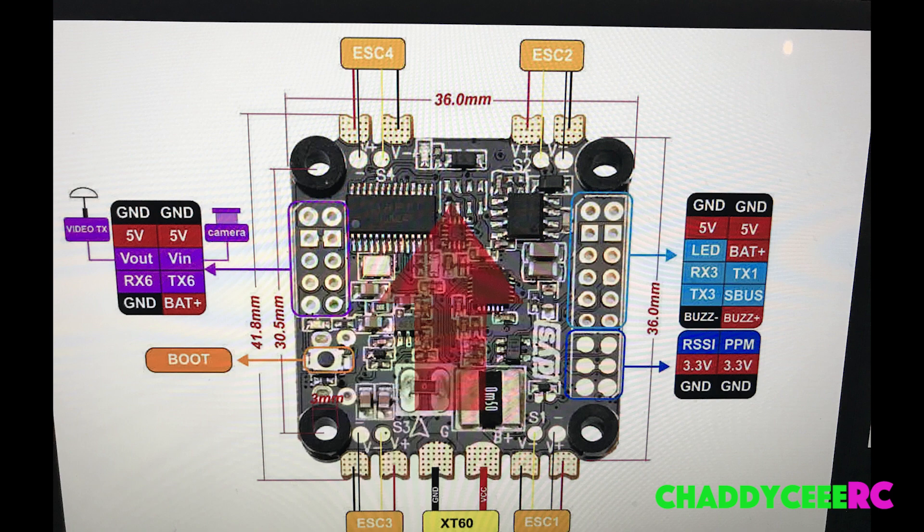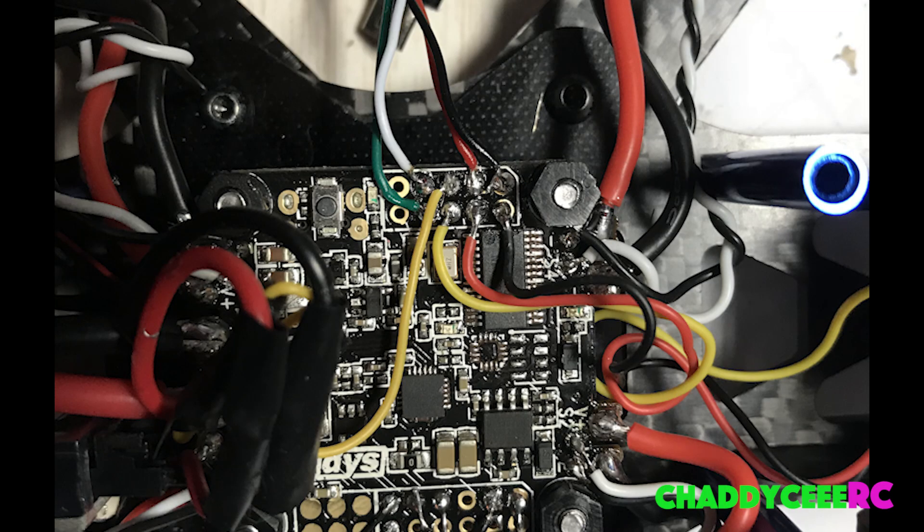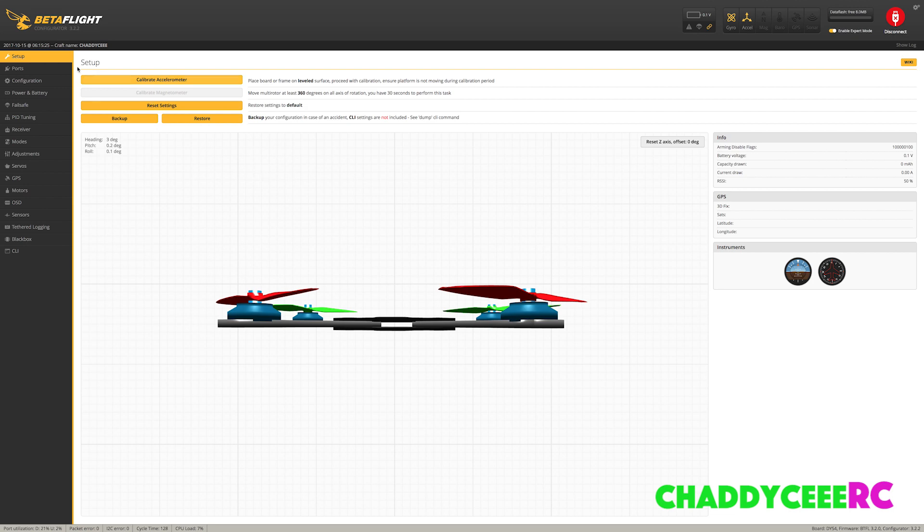When it's all said and done, this is what it looks like: power on 5 volts, the white wire going to RX, and the green wire going to TX. There are two white wires, but you're not going to use the one that comes with the connector on top. This unit also had a yellow wire and an extra white wire — I think those are used to hook up to a compass and other options, like if you're going to try to use iNav.